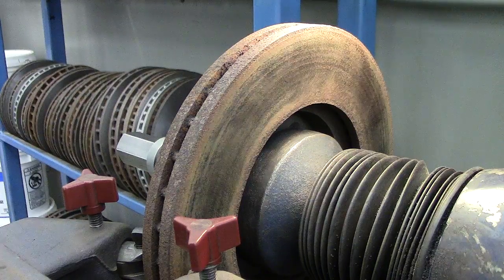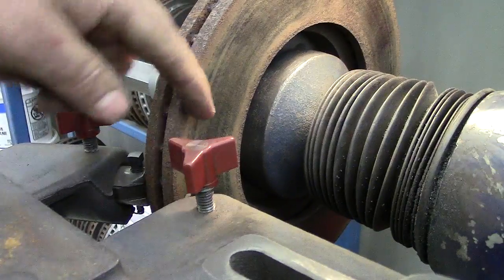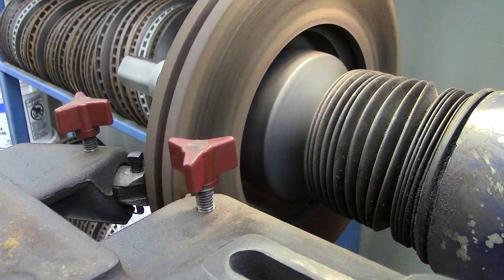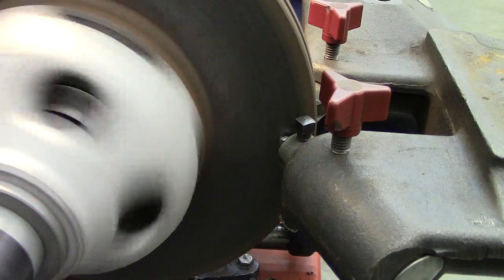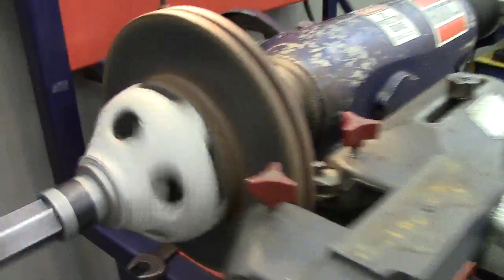Now, I'm going to bring my cutters out a little bit, and I'm going to make another pass and see if it is opposite of where it touched here. Let's find out. Now, we squared it up a tremendous amount. If I go to this side on the cutter and do the same thing, you can hear how much squarer it is, so that's saying that we even settled it down a little bit. And that's going to be a judgment call on your part on getting that set up like that.